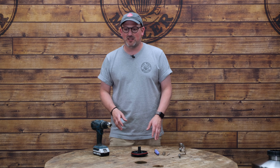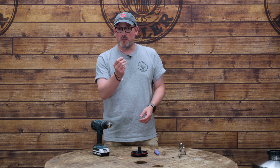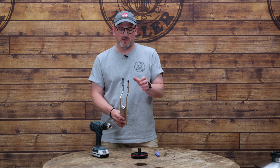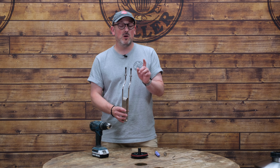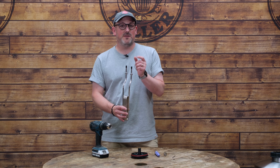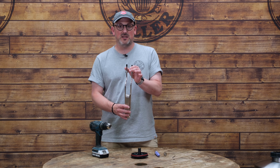And the tools that we're going to need to do this are a power drill. I've got a 6mm drill bit, and we're going to drill a pilot hole with this. And then I've got a stepped bit as well. Now I mentioned that the tubing on the chiller coil itself is 8mm. However, the threads which we need to get through the lid as well are slightly wider. They're 10mm. So that means we need to drill a hole that's 10mm for both of these to go through.